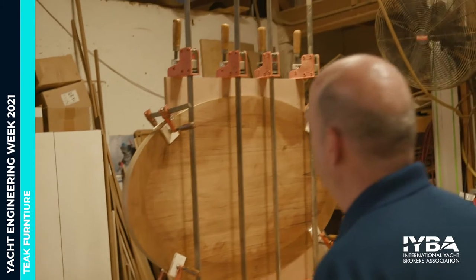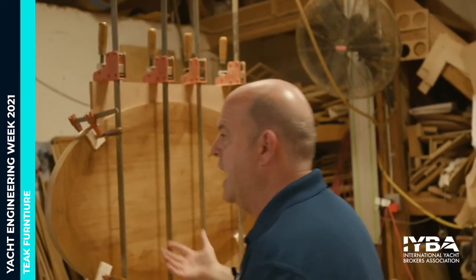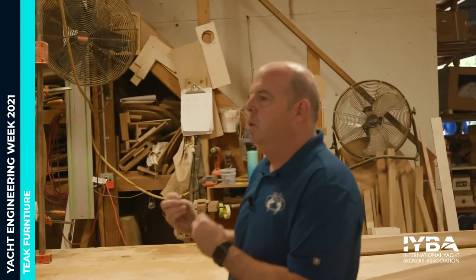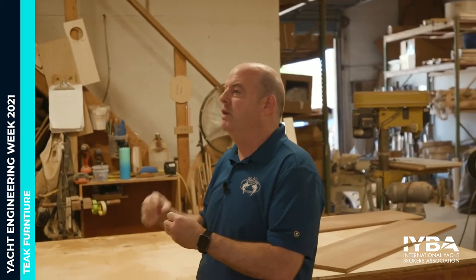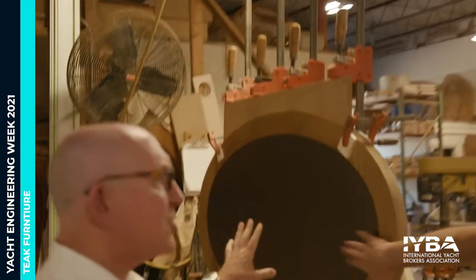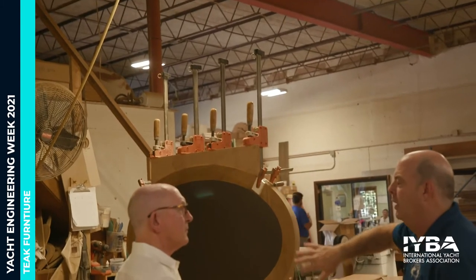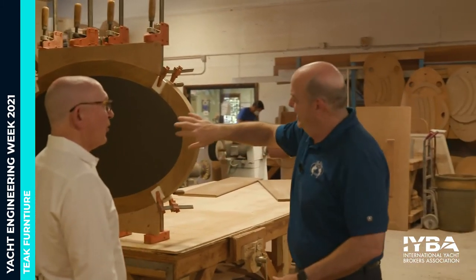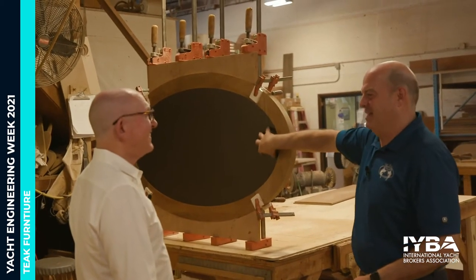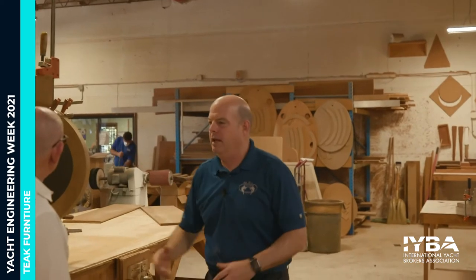That's exactly why we do it. Also, by using the quarter-inch piece in the middle, in a refinish or if a piece gets damaged, you can get in there and make a repair. A lot of times veneer gives a nice finish, but you can't get in to make a repair — usually the only way to repair a veneer is to apply new veneer. On the back side, we've got black Formica. It's twofold — it cleans up the bottom edge and makes it presentable, and it seals the back edge as well. By tomorrow, that'll be over in our finish shop — they'll nose it and edge it tonight, and it'll be ready tomorrow.